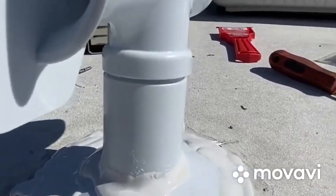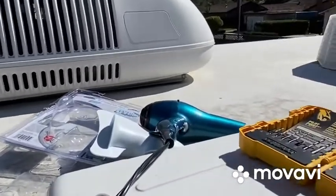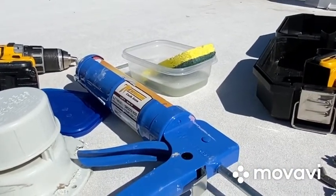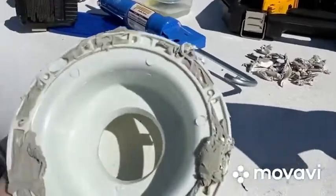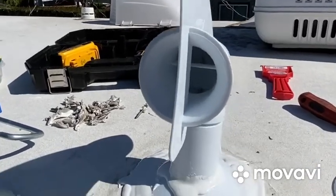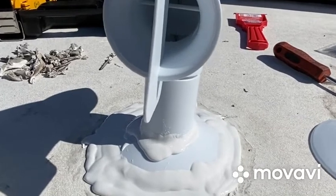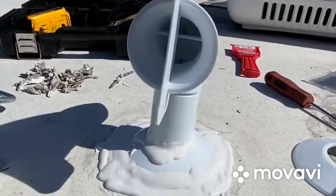All in all, tools I needed for the job: a Phillips screwdriver, a plastic putty knife, blow dryer, one 3/32-inch drill bit, drill, lap sealant, caulking gun, and some hot soap and water with a little bit of Dawn dish soap. Got that old vent off, got our new one on - look at that, it's blowing with the wind, it's already working! Gotta love that when it just starts working right away. Any questions or comments, click subscribe and drop a comment below.